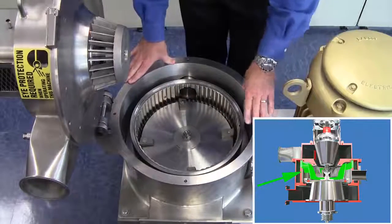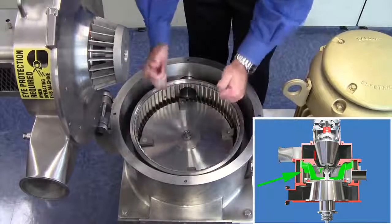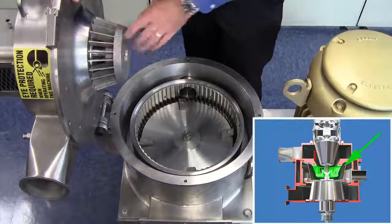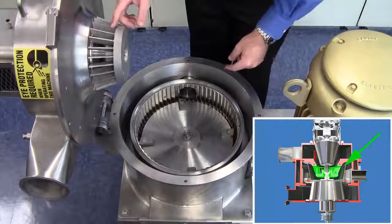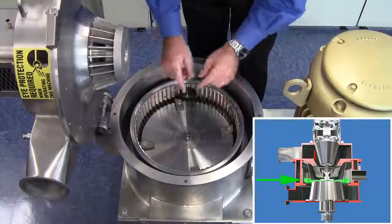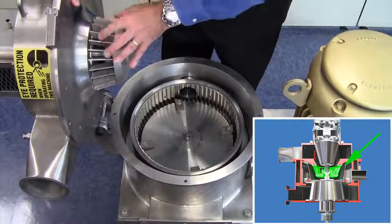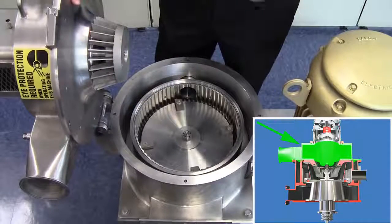The purpose of the baffle shroud assembly is to redirect the flow of particles and air from the grinding zone and present them upward to the air classifier. The air classifier is operated at different speeds to control the top size. As the particles are introduced to the classifier wheel, if the particles are too large, they're rejected by the vanes of the classifier, drop down to the center of the rotor, and fan outward due to centrifugal forces — creating an internal recirculation in the mill. If the particles are fine enough, they're removed through the classifier wheel, go through the vanes, through the volute section, and are carried out and collected either to a downstream cyclone or dust collector.